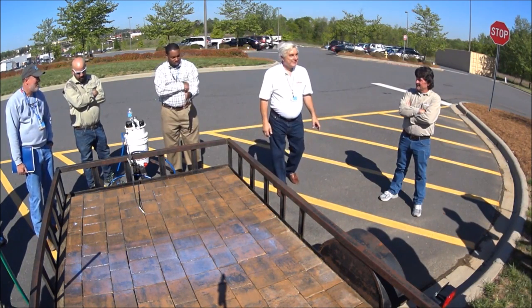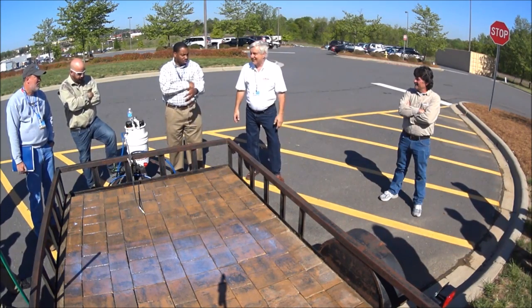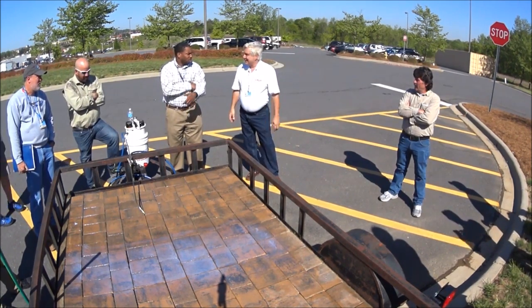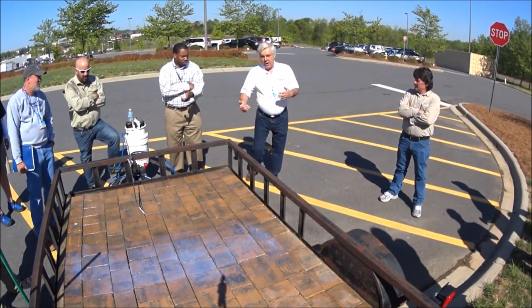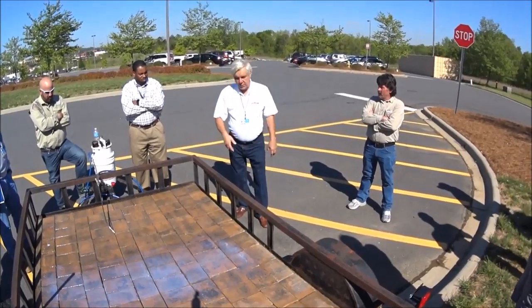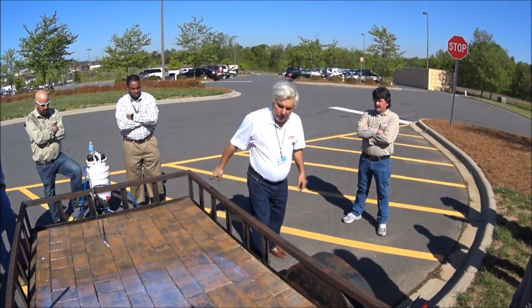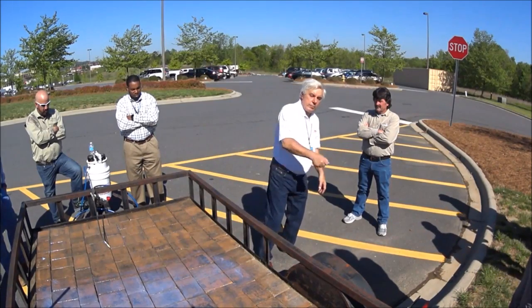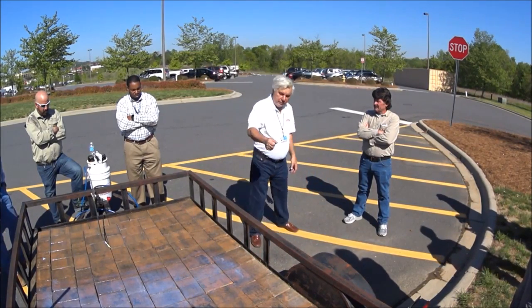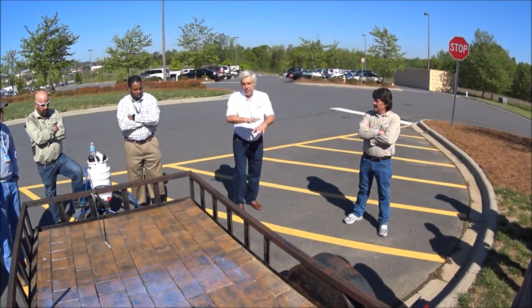So if you're doing this, I used to look like a nut out there. If you're doing this, you're brushing and walking backwards at the same time? Well, if I'm doing a driveway, I always have my broom in case I want to get consistency. So I'll do a 5-foot pass. I got my broom there. I'll just do the head weight of the broom. I throw it back another 5 feet. And I come and I broom it. You don't always have to broom though.